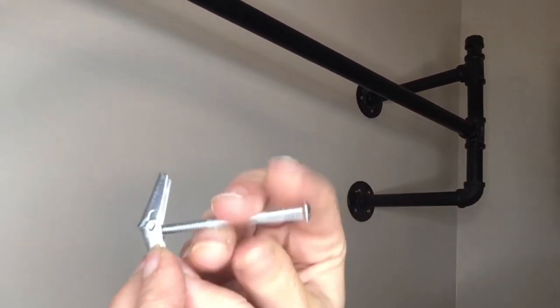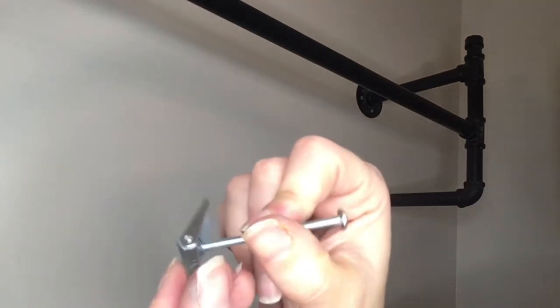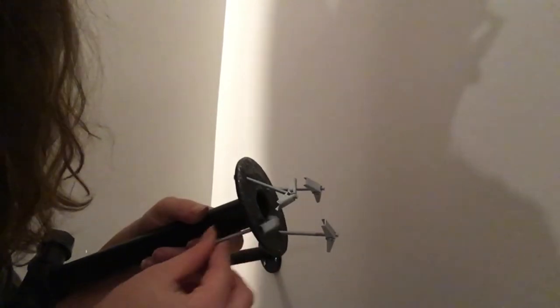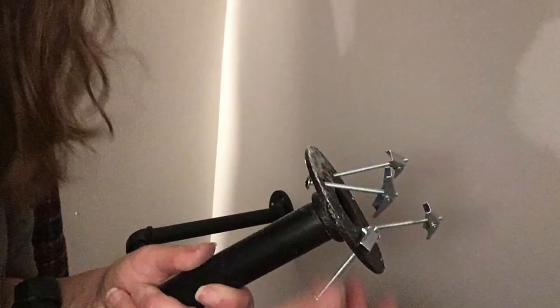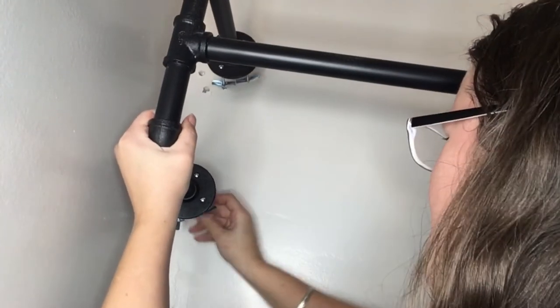Welcome back to Granite Farms. If you need to know how to hang a closet clothing rack or how to use toggle screws, stay tuned. These toggle screws come in super handy when you are not hanging something on a stud - you want to put it straight into the sheetrock but don't want it to fall down. The smallest screw size I bought was 1/8 inch, and this will hold 80 pounds per screw. With eight on one side and eight on the other, that's 16 times 80 - this is going to hold a lot of weight.